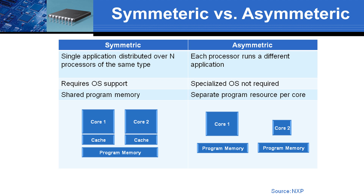Most new laptops and servers today use multi-core processors. Their cores are symmetric, memory is shared, and operating systems schedule tasks between them. For embedded systems, asymmetric cores are simpler to implement. Firmware can pre-assign tasks and dedicate peripherals to each core without an operating system. Some can be allocated dynamically at runtime, but most partitioning occurs statically at compile time.